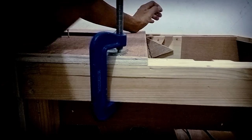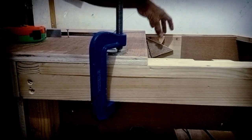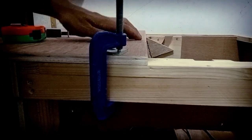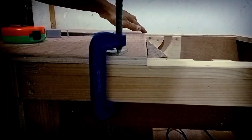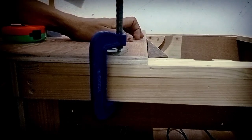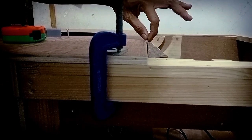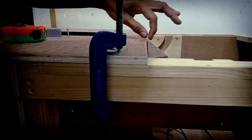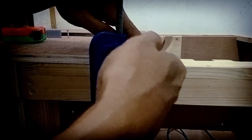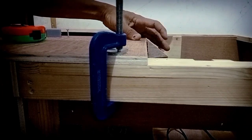The solution is: before this top table becomes a finished tool, configure and calibrate it first — check whether the blade is already on one straight line, both at straight 90 degrees and tilted 45 degrees. This is to avoid making the blade hole too large and to keep it more accurate.